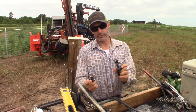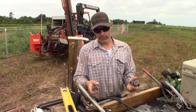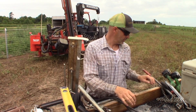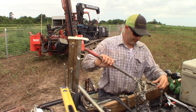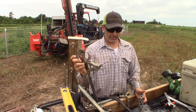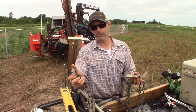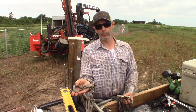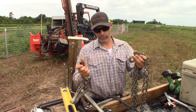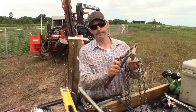Wire dogs — for a long stretch of barbed wire it's nice to be able to pull that, and if you're pulling around a corner with net wire it's good to use extra boundary strainers or chain strainers to help the wire around the corner. We also keep an old set of boundary strainers — broken chain but just the hooks on the ends — handy especially with pipe posts. If we're at the crest of a hill, to pull the net wire up and get it tied to the post, it's handy to use a mechanical device instead of trying to hold it while you tie it off.